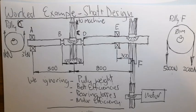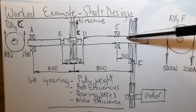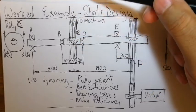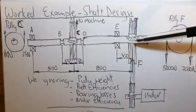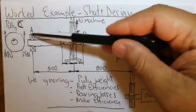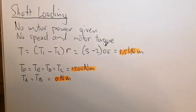A quick discussion on how torque operates: torque is applied from the motor through the belt system, and the shaft experiences torque at the belt. The torque goes from F through E, D, and to C. At C, the full torque is experienced through the belt drive to the machine. After C, points B and A experience no resistive torque. The shaft from F to C is where resistive torque acts. Thus torque at B and A is zero, while torque at F, E, D, and C equals 1,500 Nm.